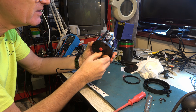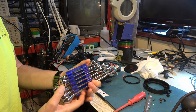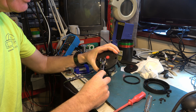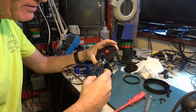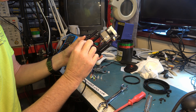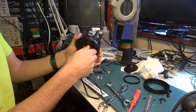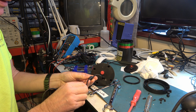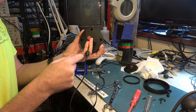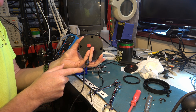Can I undo this gland at the back so that we can sort out this damaged bit of cable? These sockets are normally used for fixing brakes and clutch cables, where you have to run the cable through. This might be just the job — that seems about right, 15mm. It's a little slack. I wonder if a 14 would be better. I think it's a tight fit at 14. There's also an O-ring there which I need to make sure I put back in place. Alas, I can't fix that because there's no way of getting the wire through — if I drilled it out, you'd lose the waterproof seal anyway. So my best bet is just to put some self-amalgamating tape around the top here to keep the water out.